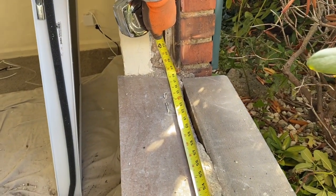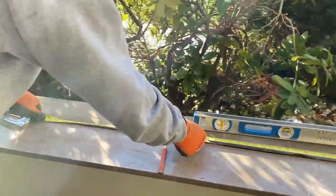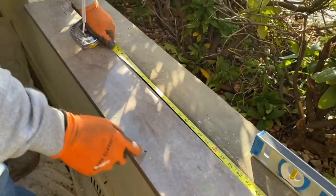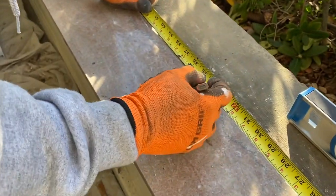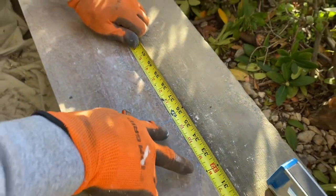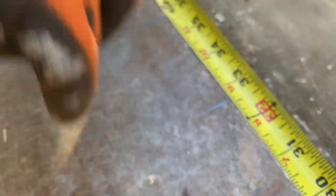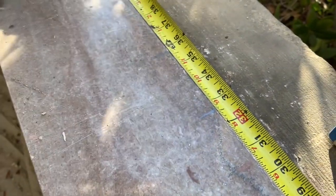We're looking at about 68 and a quarter inches between those two pieces of lumber. So we're going to mark a center point, and our center point is going to be about 34 and an eighth. You can see that one window is going to fit on this side and one will fit on that side of the center. So we'll see what kind of lumber dimension we need to fill that.